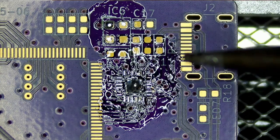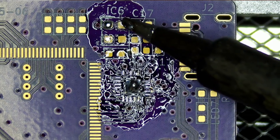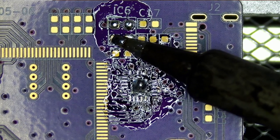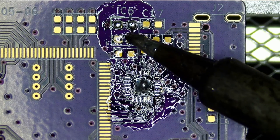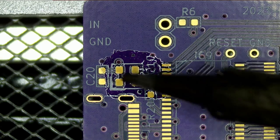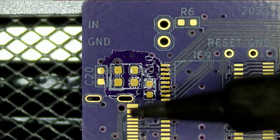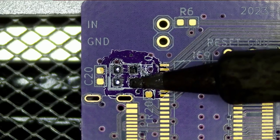These are crystals — IC6 is one of them. I guess technically they're really oscillators. I'm just putting solder on all four pads and then I'll heat them up later. And same thing for the second oscillator — all I need to do is dab a little bit of solder onto each of the four pads. If those two pads on the right look kind of funny, we'll come back to that in just a minute.